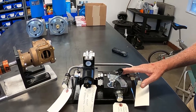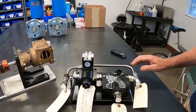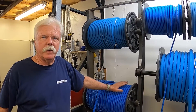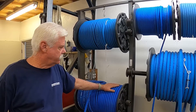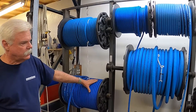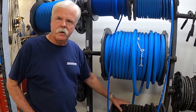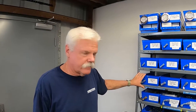If you have hydraulic steering on your boat and want to incorporate an autopilot into that system, you have a directional control valve and a flow control valve to set the speed of it. We also have the capabilities here at Seaboard Marine of fabricating custom hose assemblies — we can do pretty much all the hoses you would need to incorporate all these components together within your system. The blue hose is mostly used on charter boats where it's required to have US Coast Guard approved hose — any boat that transfers people around for hire. The black hose is more of an industrial commercial fishing type deck hose, higher pressure rating, still US Coast Guard approved, but a different application.